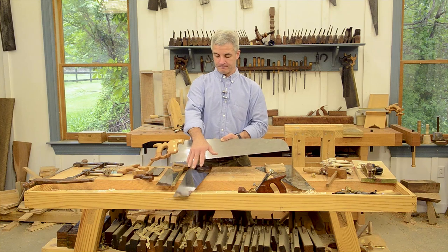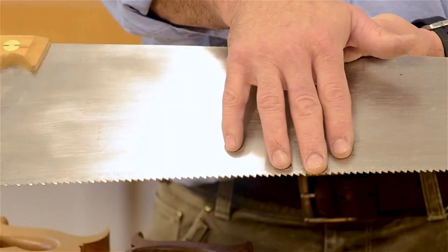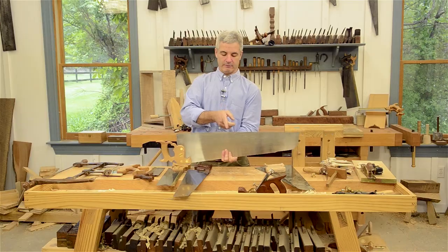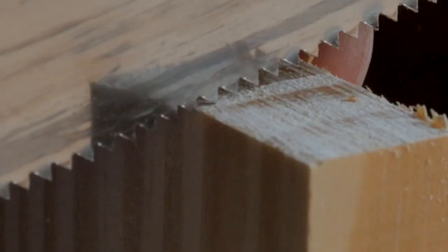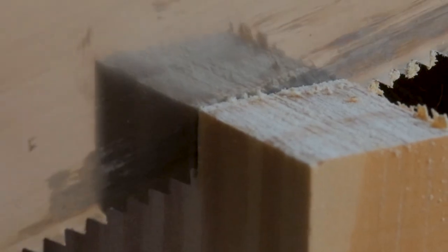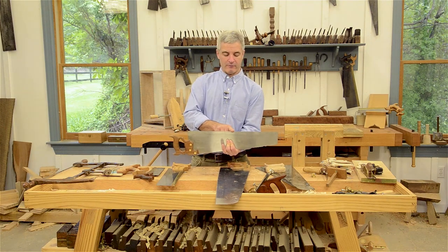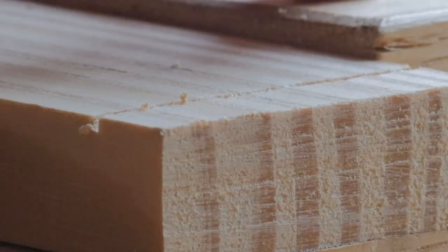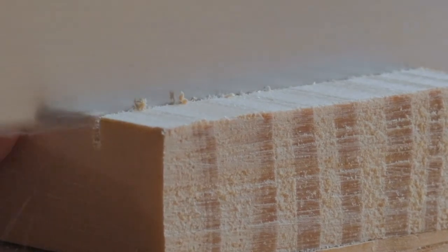In saws, you're basically going to have two different types of teeth. This particular saw has what's called rip teeth — when filing, I'm filing straight across, and what that does is make the tip of the tooth a nice straight-across cutting edge, more like a chisel. So as you're going down the grain of the wood, you're chiseling out the long grain and removing the shavings and material. When I file crosscut saws, I'm filing at an angle on each and every other tooth, and what that does is create knife edges that will sever the fibers across the grain of the wood first, then the teeth scoop out the material.